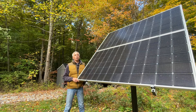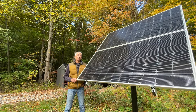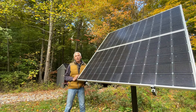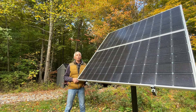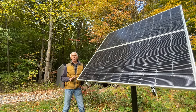So I ended up buying another charge controller that handles up to 150 volts, and that's what I'm using right now — it's running just fine. My message here is: if you get too close to the upper limit of the voltage, at least for Victron components, if they say 100 volts, they mean it. Mine triggered at 99.2 volts and had an over-voltage fault that lasted several hours.